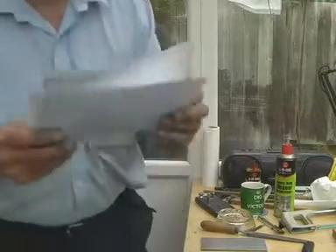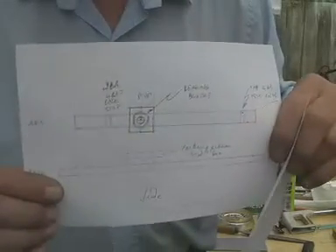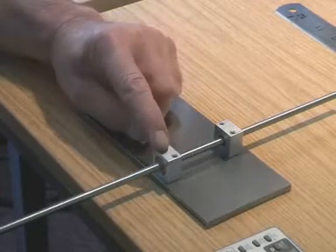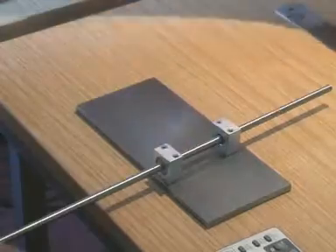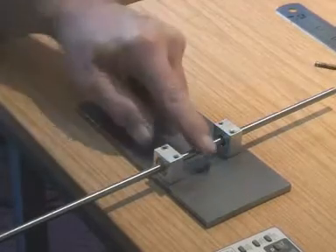We've got a nice base now, and we did design it to some extent. We've got a drawing here — a top view — showing what the arm has got to be like, and where the bearing blocks are going to go. We'll probably have to pack them up a bit from the base. Here's the base, and we've got two bearing blocks with roller or ball bearings in them. We've also got a piece of six-millimetre diameter silver steel to act as the pivot. This is the old pivot from the key you saw — it's very thin and worn, so we're going to beef it up.